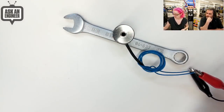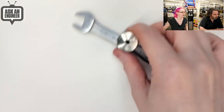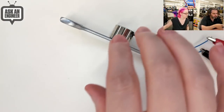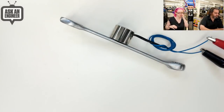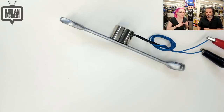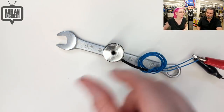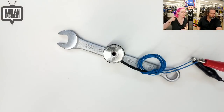Is there a current rating for the electromagnet? There is — I think this is about 200 milliamps, it's on the product page. It's about 220 milliamps at 5 volts. We'll have a couple different sizes for different weights. You can PWM it, but it doesn't really work — you pretty much use an electromagnet either on or off. You just treat it like a motor. It's a coil, so you will need a motor driver. Even though it's not moving, it still has the inductive kickback because it's a coil of wire around a piece of metal. That's how electromagnets are made.